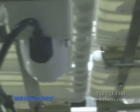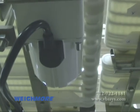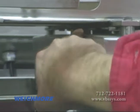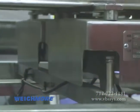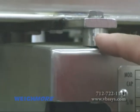If not, NEMA 4 is used, and in which case the motor is then shrouded so the cabling is not affected for washdown. The load cell spider assembly shroud is crowned so that any moisture that accumulates at any time runs off the side. Spacers are also added to space the conveyor off the shroud so there is ample room to wash away any debris.